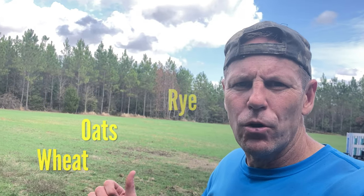All right, folks, we got this whole 1 acre plot spread. We put out 4 bags of triple 13, did it with the Suzuki ATV with the Cabela's 2.0 spreader. And like I opened up with, I really love this spreader. I think it's a fantastic product. It hasn't failed me. I will say when you clean it out, make sure you don't get water into the motor itself. I actually rinse it out with it turned upside down so water will not go in the motor, because I did have it seize up from fertilizer, seizing up one of the bearings, and I got it spinning again and it's fine. You can replace the motor in it, but that's my fault.